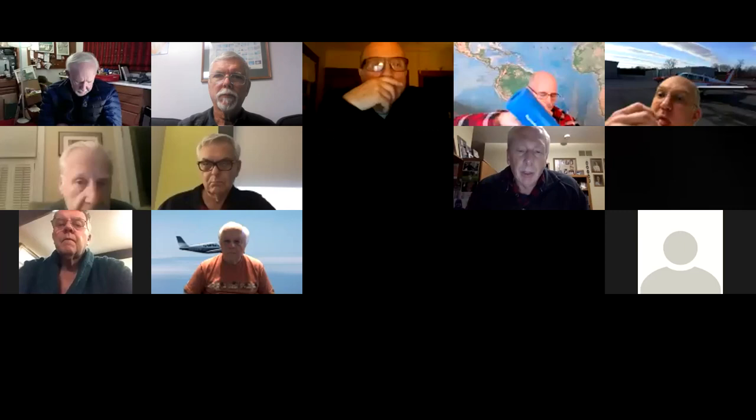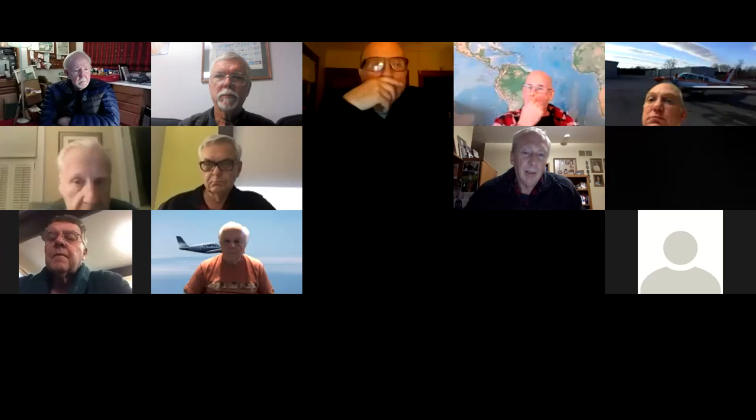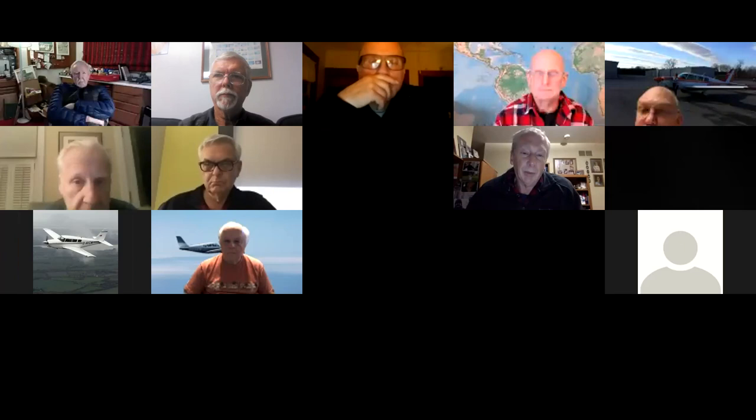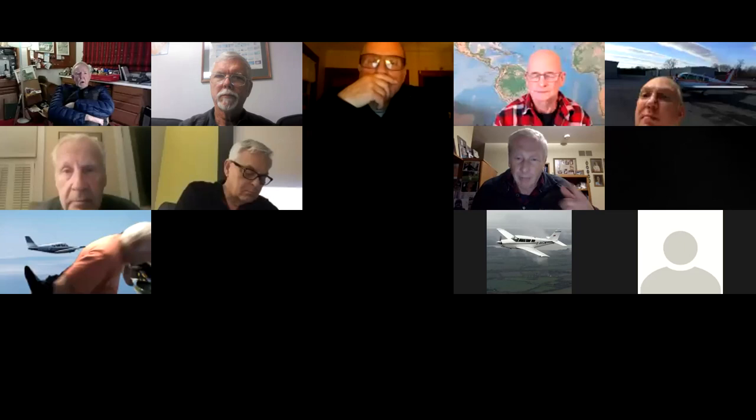We're still investigating. But what I was always told is if you put your hand on the emergency gear extension and count how long it takes to move the gear, that's a first sign that maybe you're getting some binding. But now I don't believe that, because it was always 7 seconds for me to have the gear move, and it did it up till the day it froze halfway. 7 seconds up and down? One direction. Either direction was always 7 seconds. I think that's how fast the gear motor turned, if it was free turn.